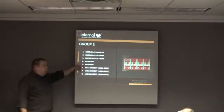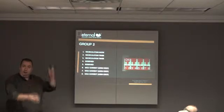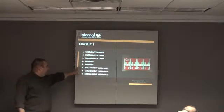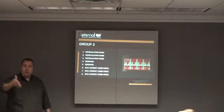So again, 1, 2, and 3 is for that recirc thing I told you about. You set your timer with the dip switches based on the timer that you want. The dip switch should be in different configurations. 4 and 5 is reserved, and 6, 7, and 8 is how you number your M units. Unit number 1, unit number 2, unit number 3.